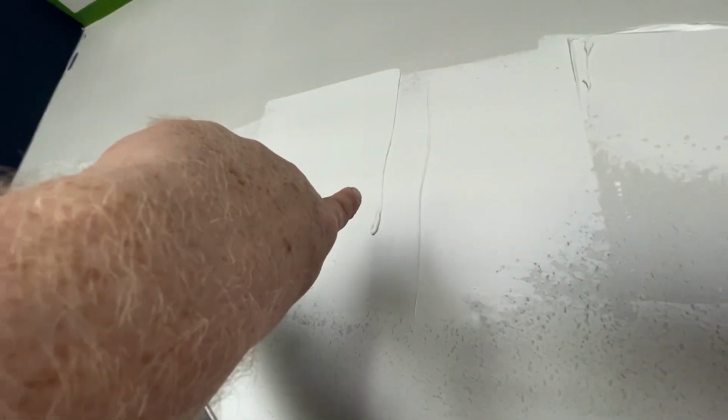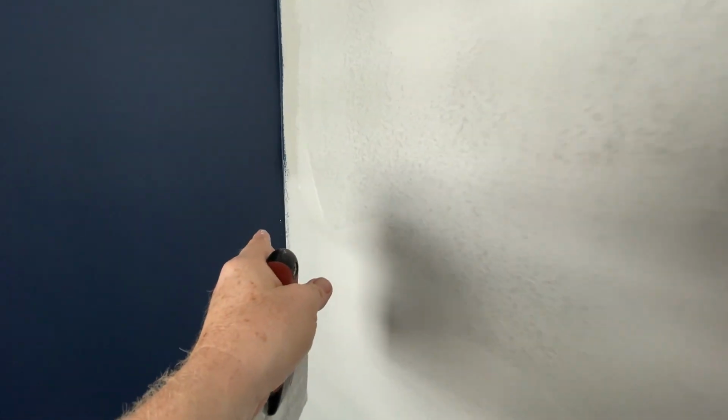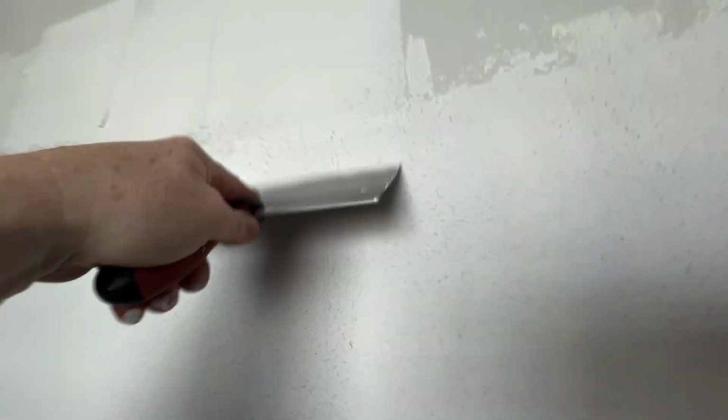You'll know when you start doing it if your lines are caused by excess, like here, or they're caused by different inflections in the wall. If they're slight, leave them alone. Let them dry. They shave off like talcum powder on your shirt after you sprinkle talcum powder on yourself. Don't worry about it. Okay? You'll know when it's an excess. See, that's an excess. Look at that. That's obvious. It's all right. That's what you want right there. Let that dry. Don't keep going over it.